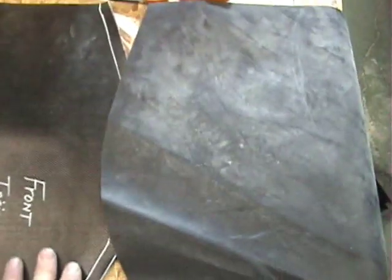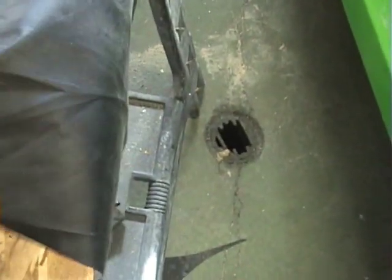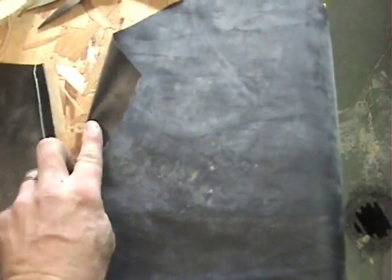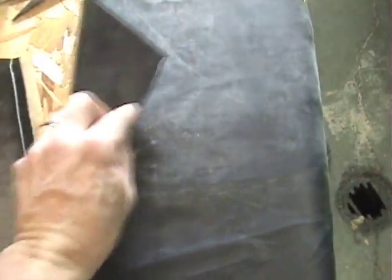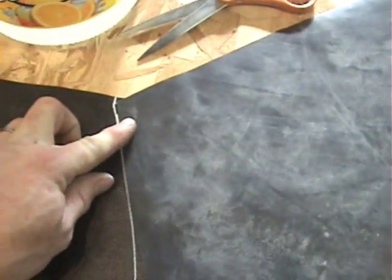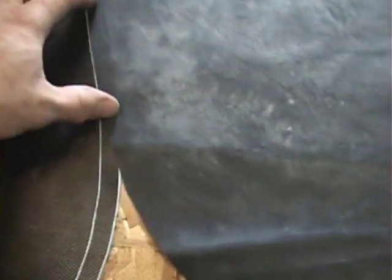When it comes to this lap method, what you've got is your piece with the half-inch mark on it. These two pieces are sitting together like this — obviously they're not going to want to go together that easily. What you do is put your glue down, working just a little bit at a time, glue your edges, and then you lap these two pieces together like this. This is obviously going to be easier at the beginning than it will be as we work down.